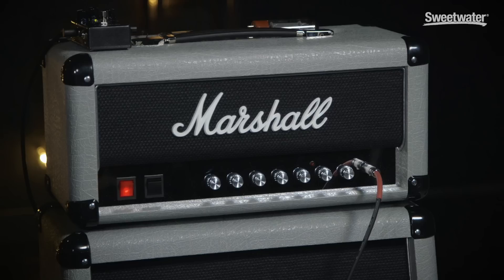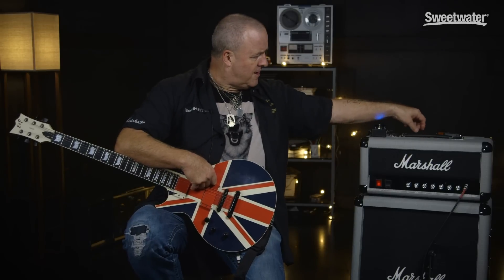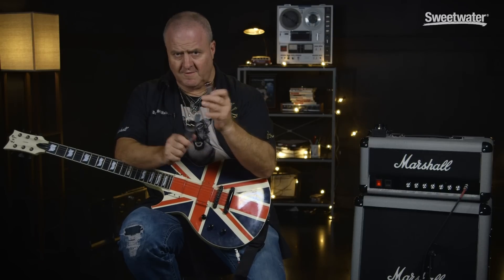I've actually got the MXR Reverb in the effects loop because it's a really cool pedal and it complements this beautifully. As far as tubes go, as per the original head, the 2555 has three 12AX7s in the front end. In the rear end, the reason this is not small is we've actually got two EL34s in there. A lot of people when they make smaller heads would put an EL84 in there, which is a great tube, a wonderful tube, but it's not the same as this. It has a different tonal characteristic and we wanted to maintain the output's integrity and tonal characteristics of the 2555. So it's a little bit bigger, but there's your reason — manly tubes.